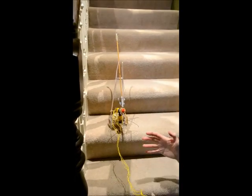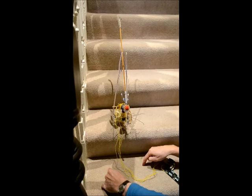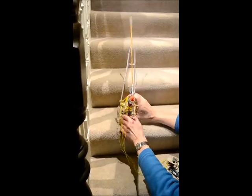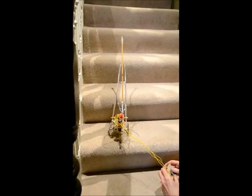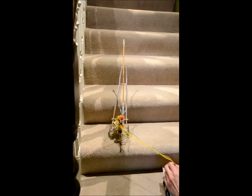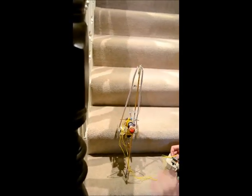So how did you balance the weighting so when it comes up and down it doesn't fall over? Oh, that's really difficult. The really difficult bit is where you're just on the edge coming down. So you have to have that at a sufficiently big angle so that the foot comes down here, not here. So I can change that by bending that a bit, that changes its angle, so that makes it much easier to come downstairs because the foot will touch down much further away. See, it's right out here, and that means it won't fall over like that.